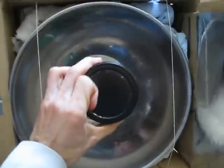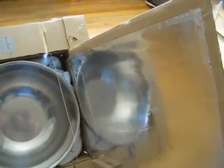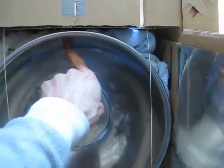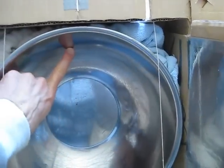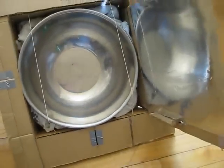So that's where the sunlight will arrive — right about here. It's not over the complete surface of the jar, but that's actually good enough. Any beam of sunlight arriving here will hit the bowl right here and reflect onto the jar, so it's good enough just to know where the light will arrive at the top. But this also told me something else: any beam of sunlight arriving right here is going to hit the bowl at about this angle, reflect off at around this angle, then go here and be lost. So that's almost useless.